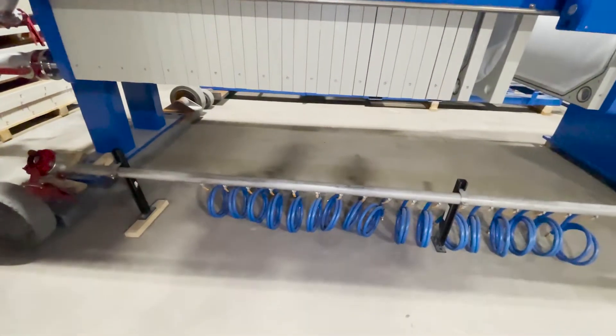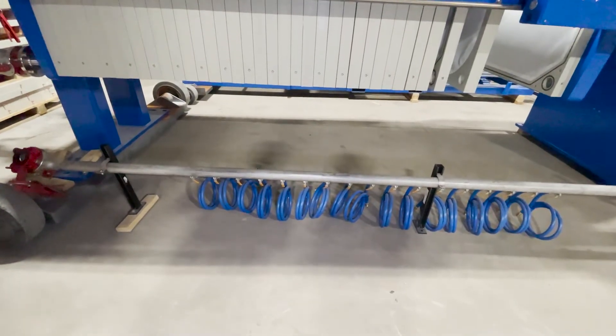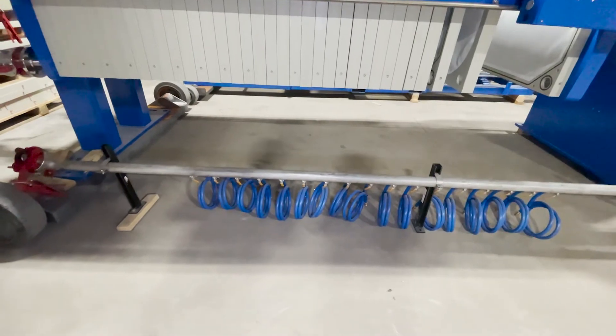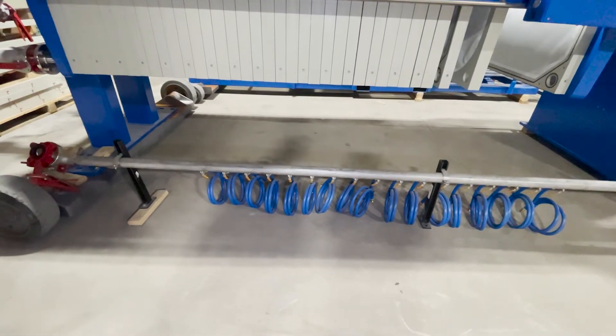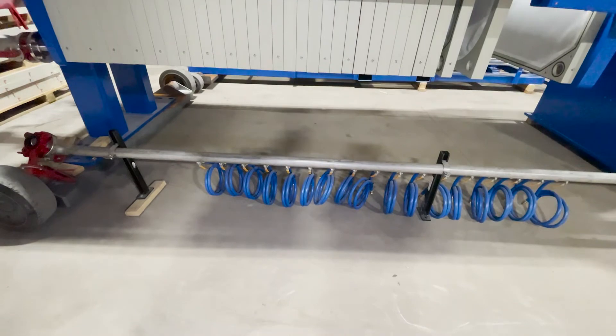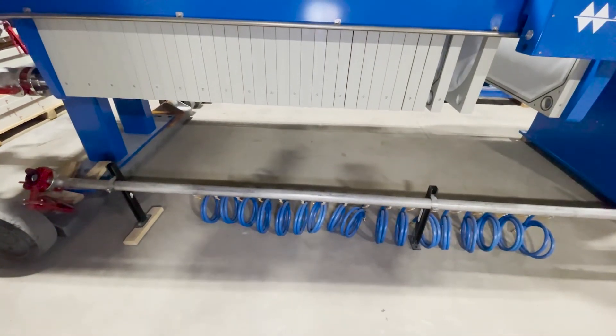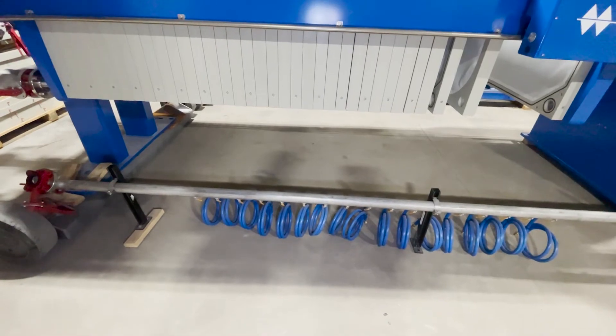This pipe down here is the squeeze header. The squeeze skid you saw will send pressurized water into this pipe. Each individual hose will connect to each membrane plate to do the inflation of the squeeze plate.